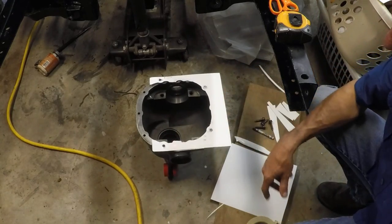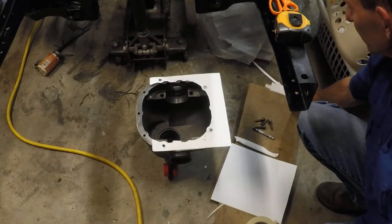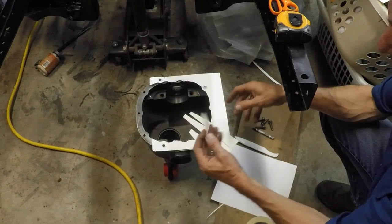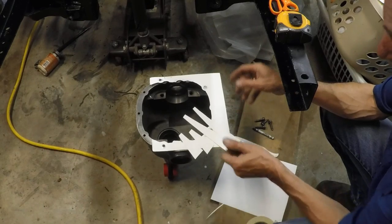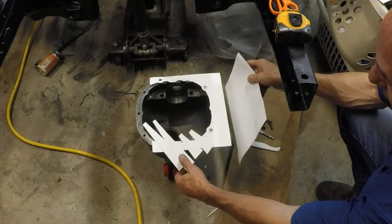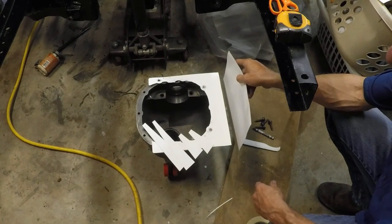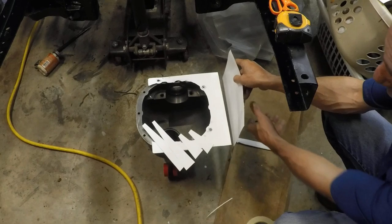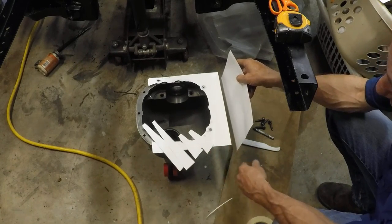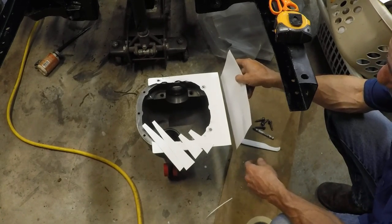Here's our pieces — at least a good start. This is the piece that goes on the differential. There are four gussets — two on the top, two on the bottom — they're literally just triangular pieces, two pairs. And then this is going to be the mockup for the back piece. This piece will sit back here and there'll be a two-inch pipe — it's got about two and three-eighths, two point three seven five OD — coming out of center here. We'll trim the back plane down to what's reasonably necessary and we should be ready to go.